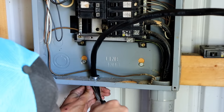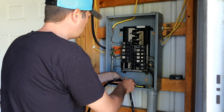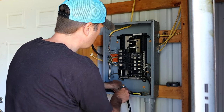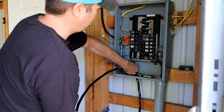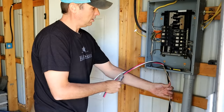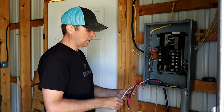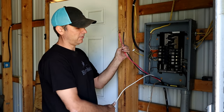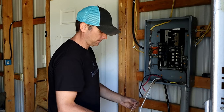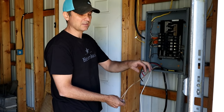I'm gonna tighten this down. Just lightly scoring — make sure you don't cut into your conductors. You should be able just to wrap that off. With the 50 amp, you actually have two hot legs, unlike a 30 amp. Where the 30 amp RV plugs have a hot, a neutral, and a ground, the 50 amp has two hot legs, so you have 120 and 120. You have your neutral and your ground, so that's why you have to get a six-three cable.